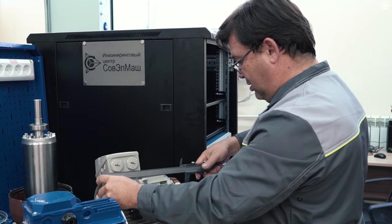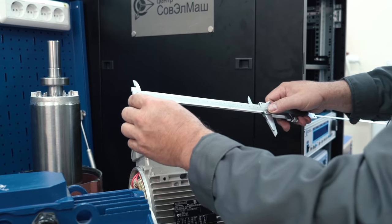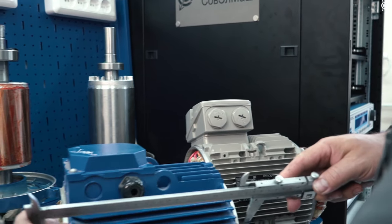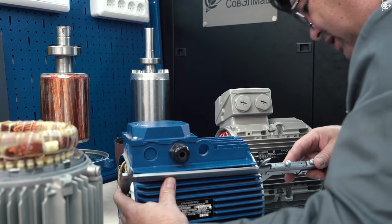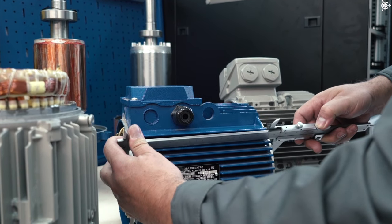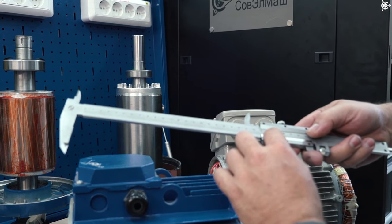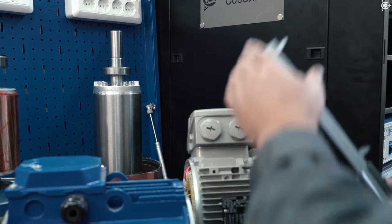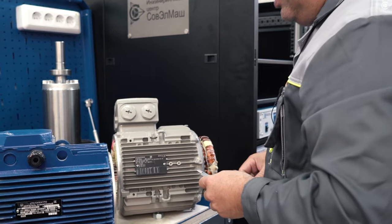Now the copper. The IE4 motor is 256 mm in the copper part. For the standard one, I can measure it — I can touch the copper part from this side, but on the other side it's somewhere deep in there. We can only measure it roughly: it's about 235 mm, minus something that goes deep in there, about 15 mm minus.